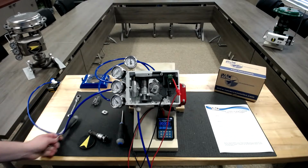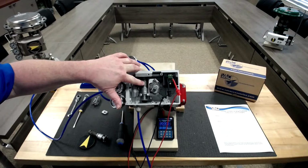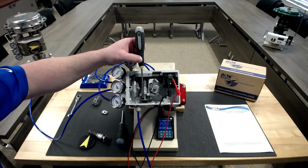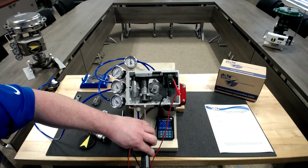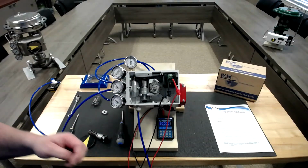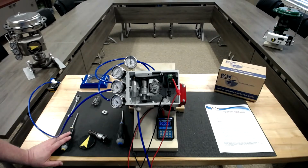We do have on our website, in our technical quick help section, a document that we have written up that will show you how to reset this range spring. Basically, without the sheet in front of me, what I'm looking for is roughly 2 to 3 threads showing on the span range here. And what you can do is run the 0 until you feel it start to bind, stop. Then turn to reverse directions with your screwdriver and count your turns until you feel it binding the other direction. Once you feel that, divide that number by 2 or go back half as many turns the opposite direction.